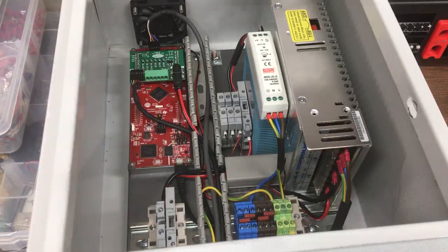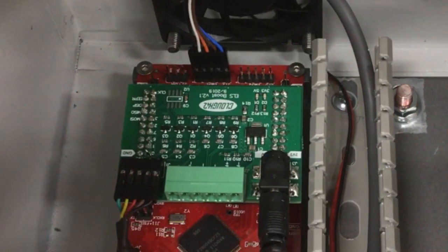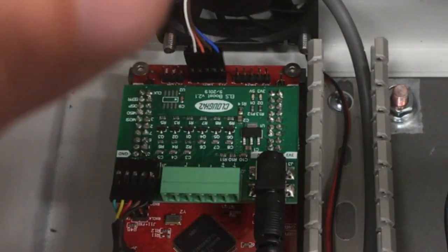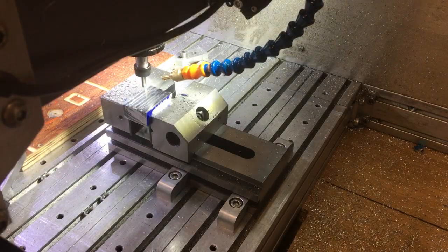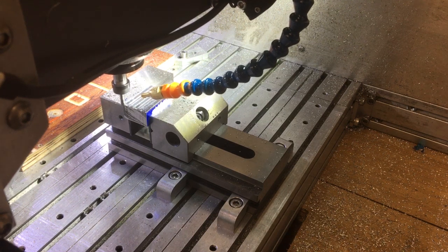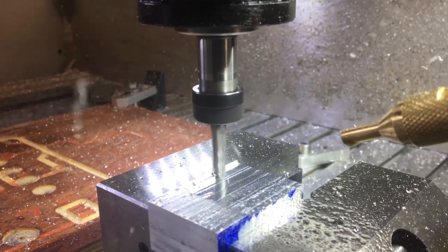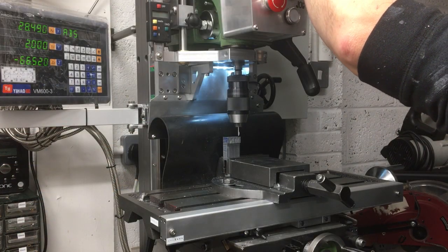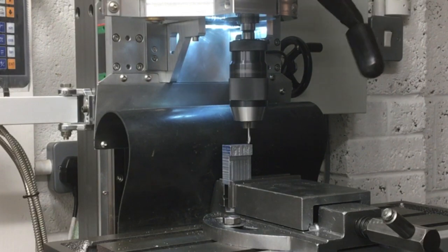We need to get the basic system working first. While we're here, let's talk about these DuPont connectors. I've found them very fiddly to make — they're little pins that are awkward to get into the crimp. So I thought I'd make a fixture to make it a bit easier. It's just a little off-cut piece of aluminium: I put it in the CNC machine, machined the top flat, machined a little pocket, and then brought one of the ends down to final size. Then it was over to the drill press to drill the little holes, marking them out first with a spot drill.